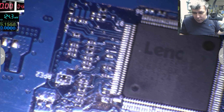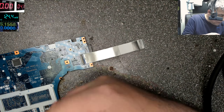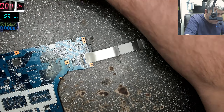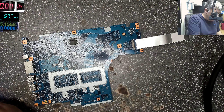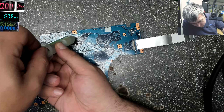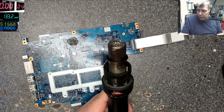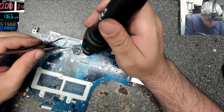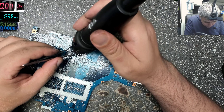Okay, let's get the chip out first — that's the easy part. Let me find the right tool, my special tweezers. Okay, let's use some flux. I want to check after I get the chip out if anything is shorted.